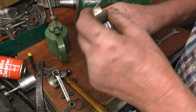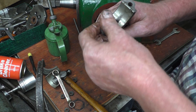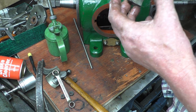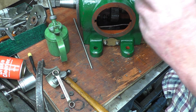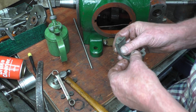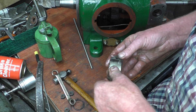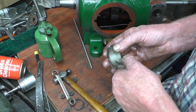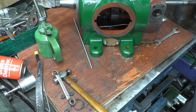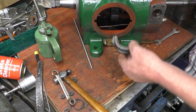These are the bearings — a split shell bearing. There's a little locator there; that doesn't stop the bearing turning, all it does is locate the bearing. You see the oil hole lines up with the hole for that tube. That oil feed went to the flywheel — I remember that and I've just checked the video. There's also a pop mark on that bearing cap that I put on, and there'll be one on here as well — there is indeed. It just helps the bearing cap slide into the cap easier. It's always good to have two locating references like that. It's the clamping force of the cap on the bearing that stops it turning, not the little locating lug.